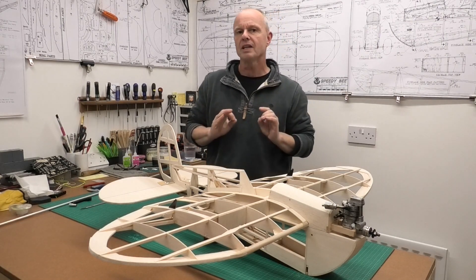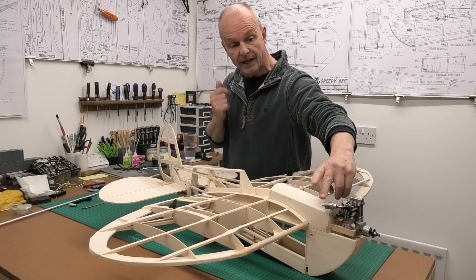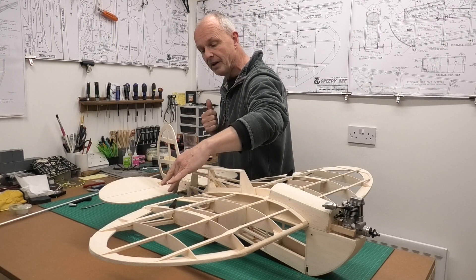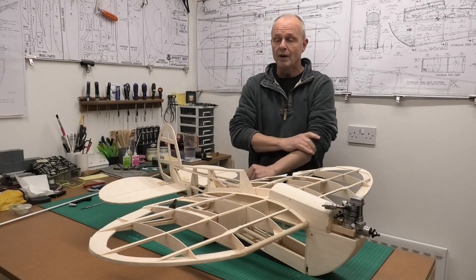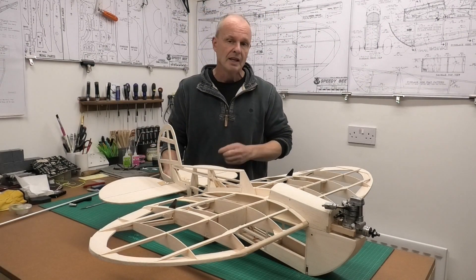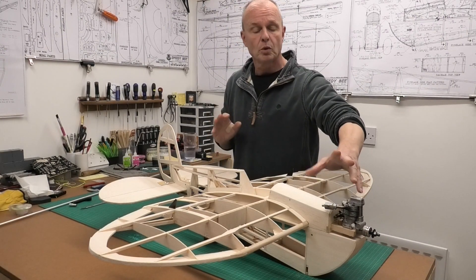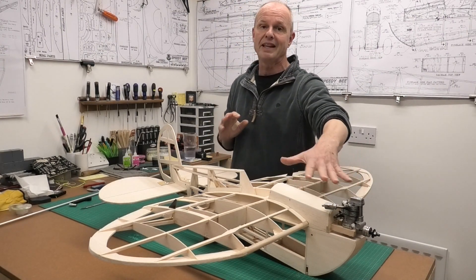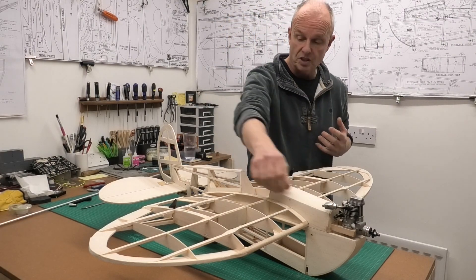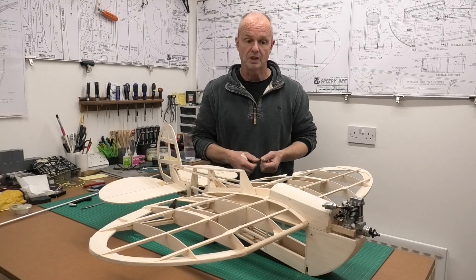What I'm thinking of doing is making a custom pipe that will travel from the existing muffler, along the wing, and down exiting under the tailplane to get rid of those oil fuel residue gases. We need to be careful because the last thing I want is to add back pressure and make the engine not run properly. My experience is that custom pipes work fine as long as you don't restrict them too much.